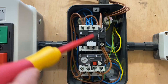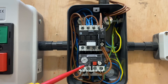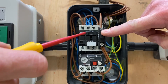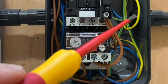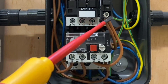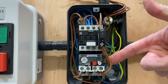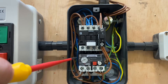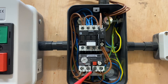There is something slightly different on this one. On the drawing we showed a separate stop button, but on this one and on many online starters the stop buttons are actually interconnected into the overload relay. The green button on the front of the direct online starter is this one, and the red button is this one — for the stop. Normally on the drawing we went from here to the stop button and then out into 95 or 96. In this case we come directly from here going through all the way into 95. When you buy an online starter it only comes with the contactor — you buy the overload relay separately — but you just have to physically do the connections into 95 and 96.